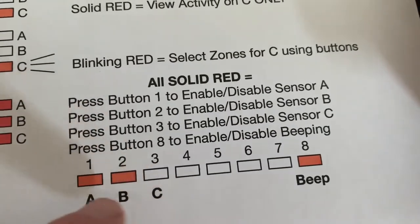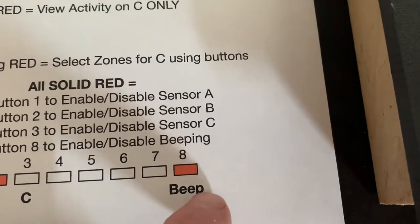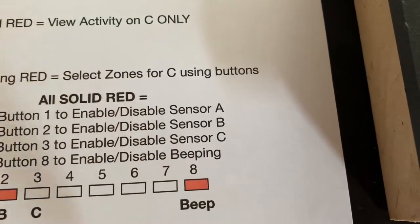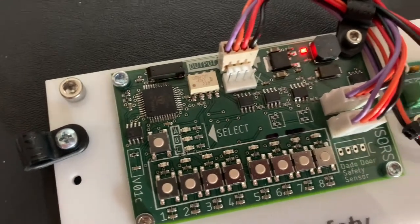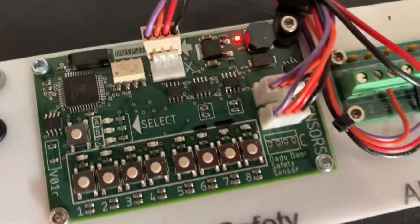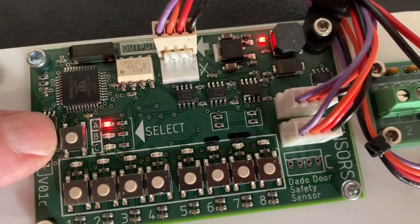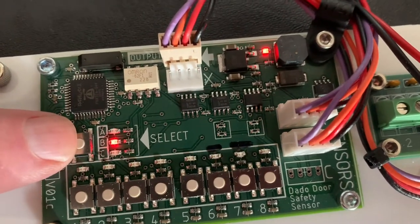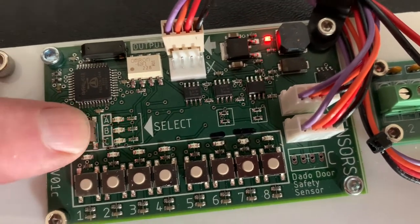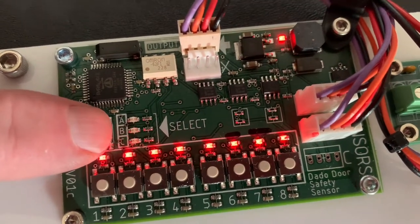You can turn on or off up to three sensors. If you want two on, you'd have those two lit. If you want beeping to occur when it detects motion or a target that exceeds a temperature threshold, you can have the beep on. When nothing is selected, there are no LEDs on the select LEDs. Selecting one gives solid, two gives blinking, the third state is B solid, B blinking, C solid, C blinking.